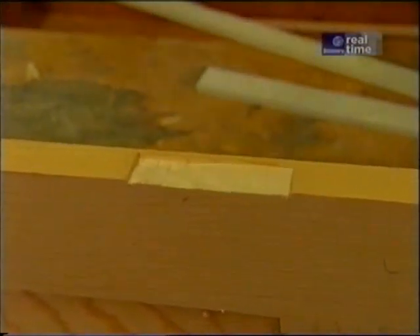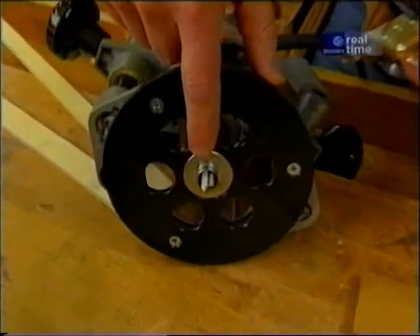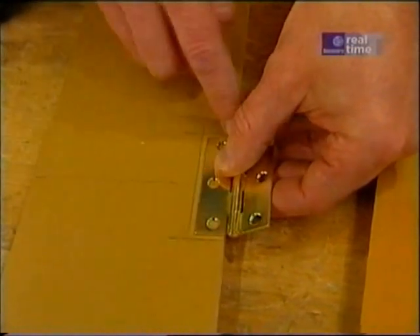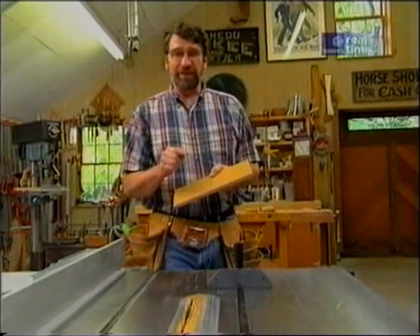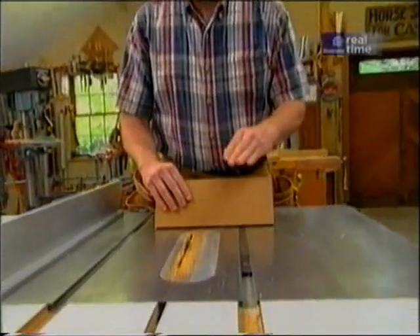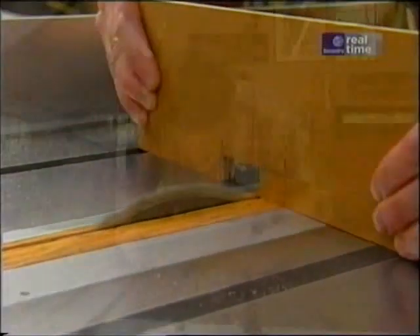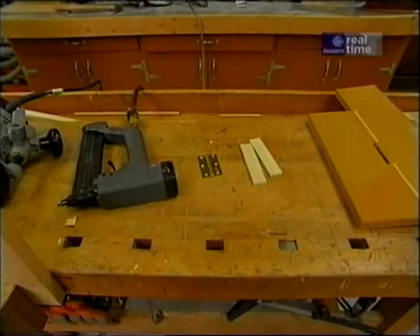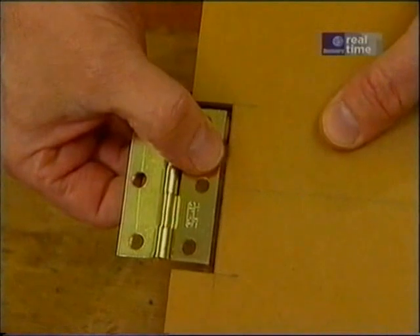Now let's suppose I have a room full of doors to do — I want to make a jig. I start out with a router with a five-eighths-inch diameter collar and a three-eighths-inch diameter bit. That means that the bit is an eighth of an inch smaller than the collar. So I take a piece of plywood and I lay out for the hinge an eighth of an inch bigger on three sides. I'll remove this material over at the table saw. Cutting this notch accurately is a very important part of making this jig, and it's really the only way you can do it — I wouldn't try to cut it with a jigsaw and I wouldn't cut it on the bandsaw. What I want to do is bring it in using my miter gauge and nibble away the material. Okay, that takes care of the notch — I've got an eighth of an inch all the way around to accommodate the collar on the router.